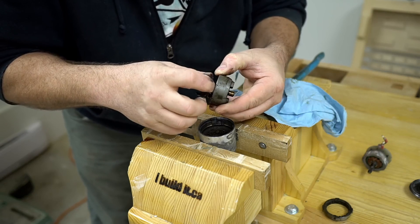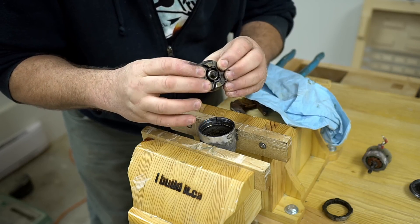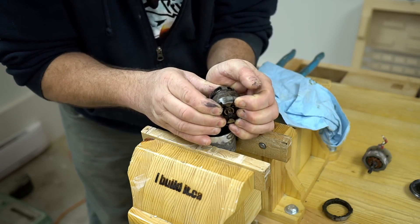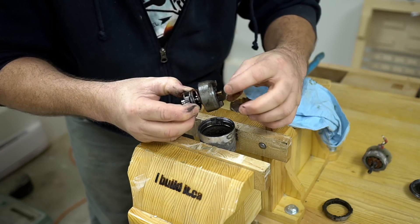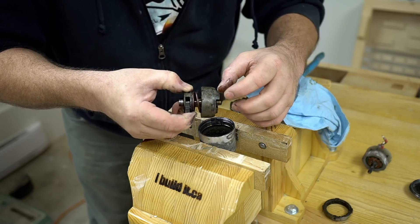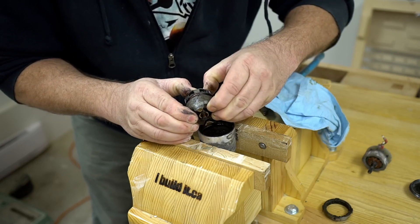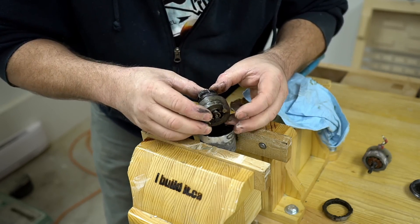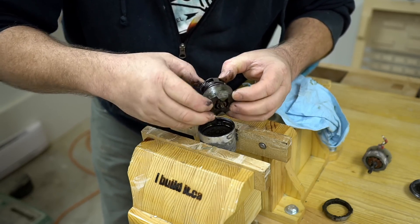This part is one solid piece. Like I said on the other one before, my spring broke here, and that's what spring-loads this. I don't know if this is called the hammer or the anvil part — I think the part inside is actually the anvil. You can see this part pushes back like that. As this spins around, these edges of the hammer strike the anvil, and then they slip up because it's slightly angled, so it slips past the anvil and swings around. Momentum is on its side, and it comes around and makes contact with the anvil again — that's that really hard striking you get with the rotary motion.